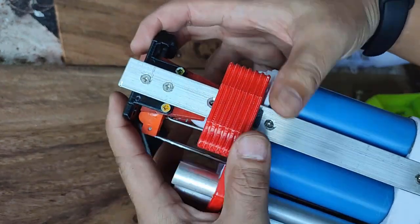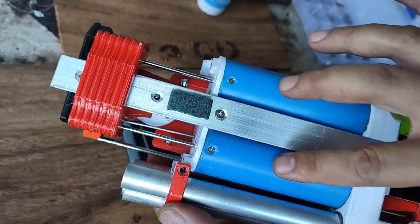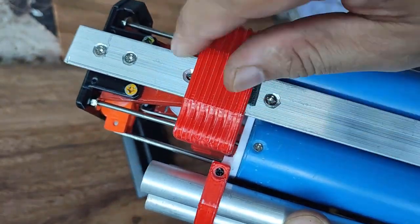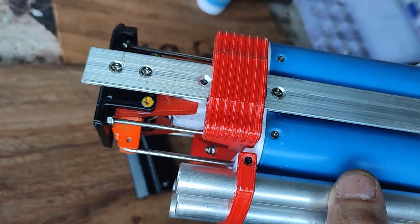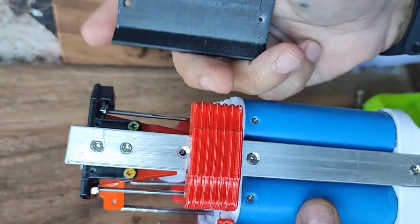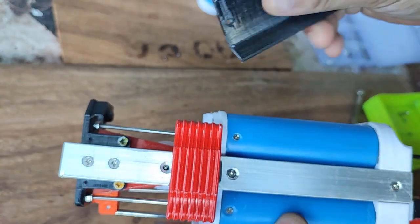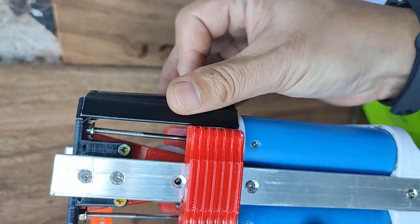In this prototype, priming is quite difficult because you're pulling two springs at the same time. That's how the catch catches the plunger rods. I put a foam piece just to retain the priming position so it won't slip forward when the rods are primed. In the updated STL files, I've already included a primer retainer mechanism incorporated at the bottom cover — it has a plastic spring that pushes against the priming device gently so the plungers stay primed. This attaches here like that, and that's it.